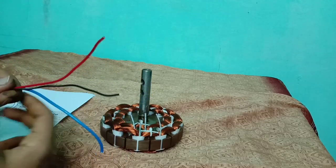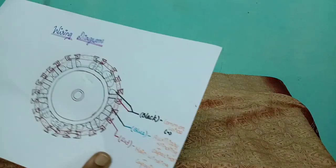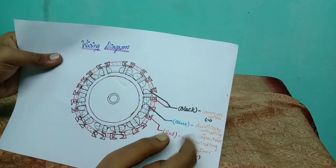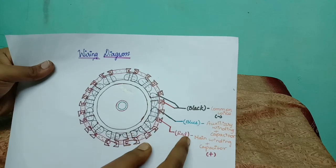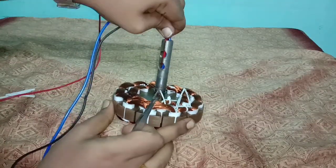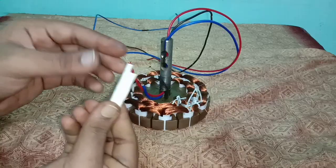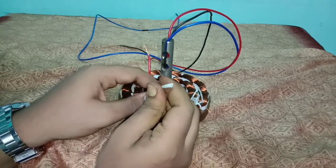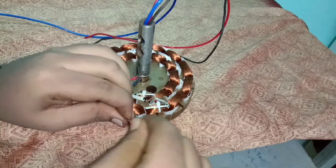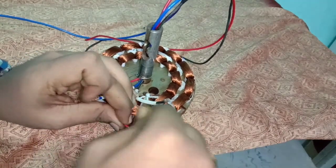I have selected three different coloured wires: blue, black and red. This is the wiring diagram. Black wire is for common, blue for auxiliary winding and red for main winding. Insert the wires inside the shaft and pull them out using forceps. Take insulation sleeve of size number 3 and cut it into 3 similar pieces. Insert the wire and then insert into the connecting wire. Join the lead wire with the connecting wire — black is for common, blue for auxiliary winding and red for main winding.